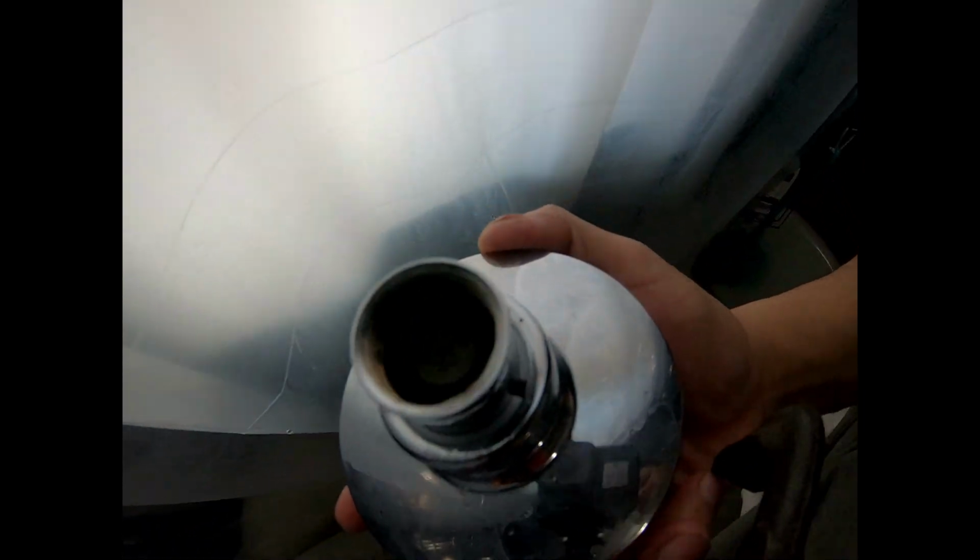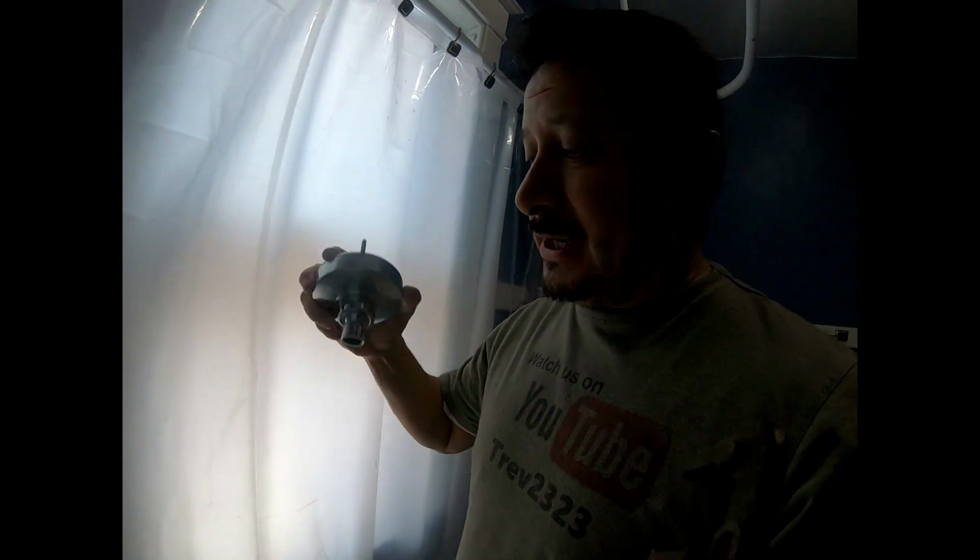And then a lot of times, if you're having water problems, you could look on that screen. There's a screen in there, and you'll see rocks on that screen, because if you're in an old house, the pipes have little rust deposits that'll come through there. So you could kind of hit this on your hand to get some of those rocks out. Do not hit it in your sink. I learned my lesson. I cracked my sink one time hitting it on the sink.